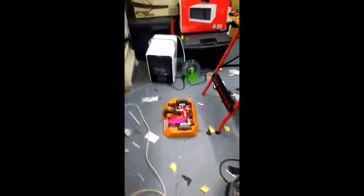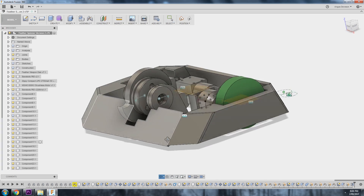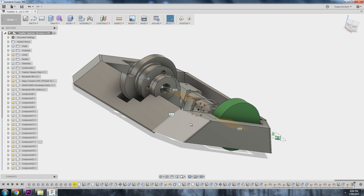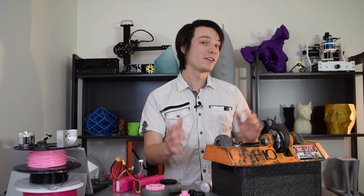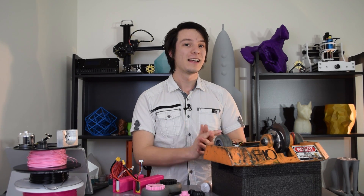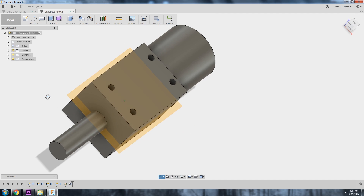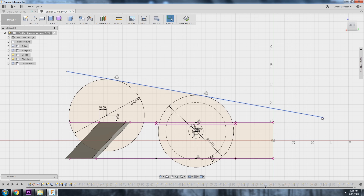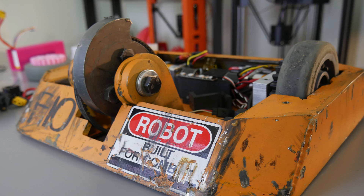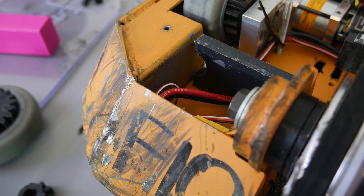That's the design intent of Vanguard. The design was drawn up entirely in Fusion 360, and the final CAD is a huge mess after being chopped and changed so many times during the build process. My biggest mistake was not creating components of the frame members early on, which means the timeline is a huge disaster trail — this is the most complex assembly I've ever drawn entirely in Fusion. I learned a lot about its quirks compared to something like SolidWorks. The 3D model served as a really good indicator for design decisions, such as the larger wheels to ensure the machine was invertible — if it got flipped, it could still drive — and I was really chuffed with how well these compound angles came out.